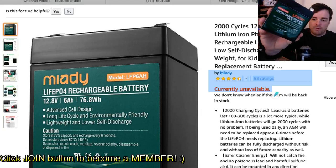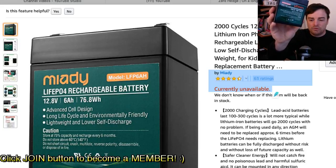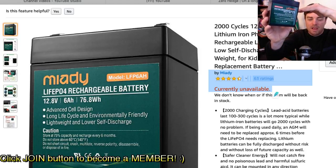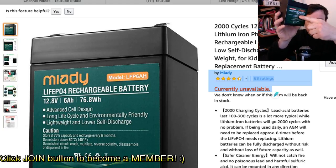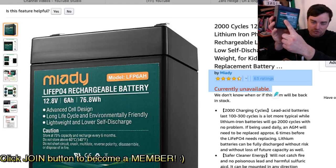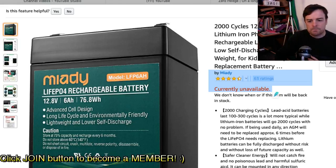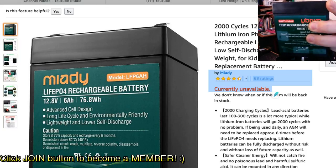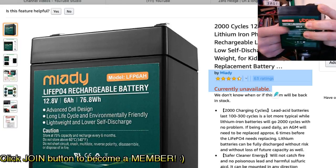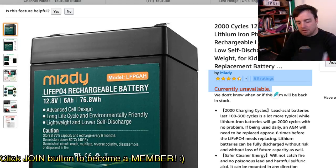These will provide backup so we can drain them first. Because LiFePO4 batteries always sit at a high voltage — around 12.8V for a long time — all the energy gets pulled from these first, and the overflow comes from the AGM. So these get cycled before the AGM, which is perfect. I've seen reviews where people have done exactly that and found it draws from these first, and once these are done it starts drawing from the AGM. When you start charging, these charge up first and then the rest of the power goes to the AGM. As long as you've got these in parallel, you can draw a fair bit.